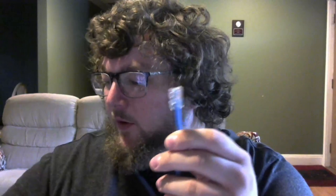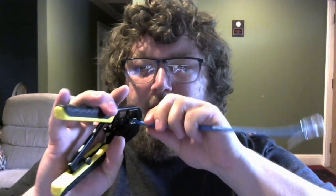Take your crimper tool and find the RJ45 side — you can tell it's bigger. Feed the terminated end in just like it's a regular Ethernet cable. Since I don't have a full pass-through I trimmed the extra ends off first. Then grab your crimper, feed it in, and squeeze all the way until it stops. And that's it — you've successfully terminated your first patch cable.